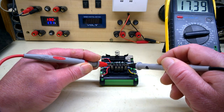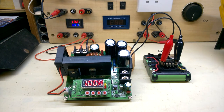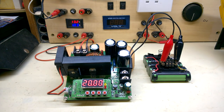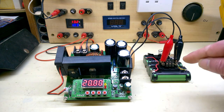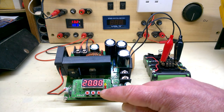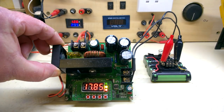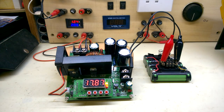17 and a half volts. I need to make sure that it charges before I put it back together. This is a boost converter set on 20 volts — the original charger will be about 21 volts and about one amp. Just for a few seconds, there's no balancing in this pack, so just make sure it accepts the charge. It's increasing — that's fine, that's good enough.